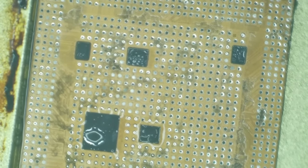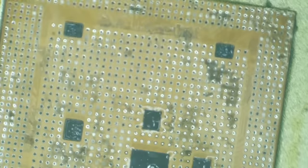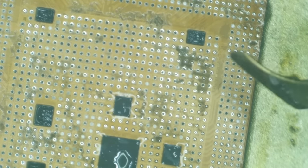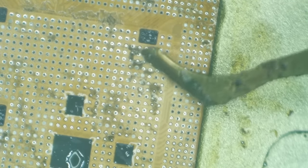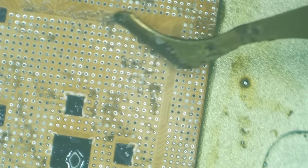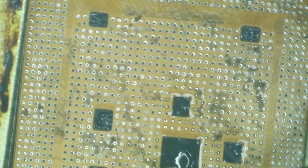And if I pick that Q-tip up, I'm going to flip it over and use the other end, because the heart attack that you have whenever you realize that you just put a scratch across a handful of pads is just, it's awful. Okay. Spin it. Use my blade a little more over here. Everything's going to be just fine, folks. This is all completely normal. I'm sure Apple meant for human beings to be swapping these CPUs from board to board. This was all part of the plan.